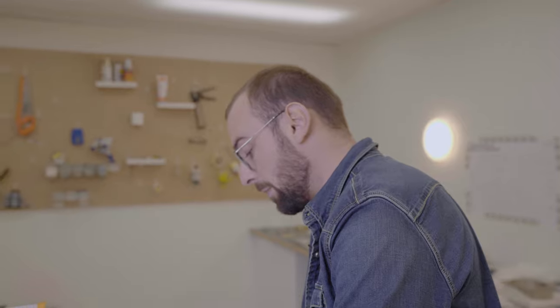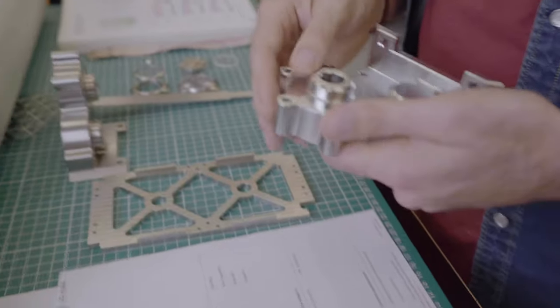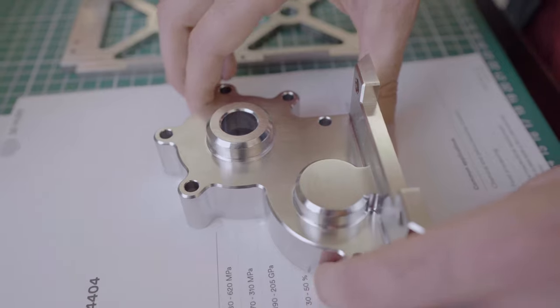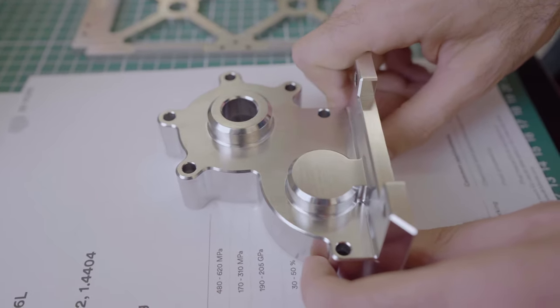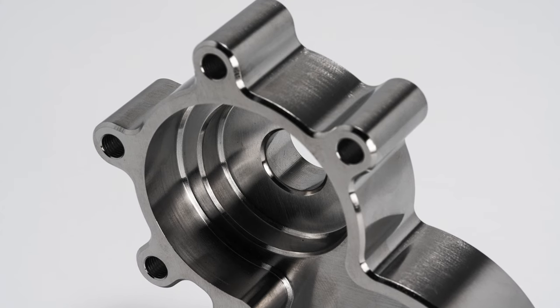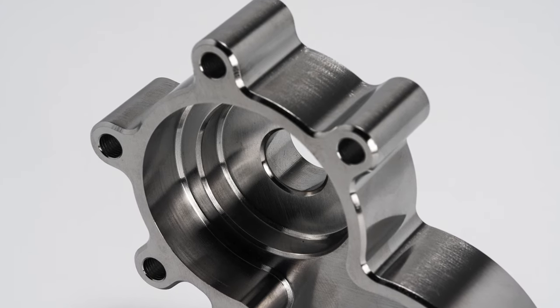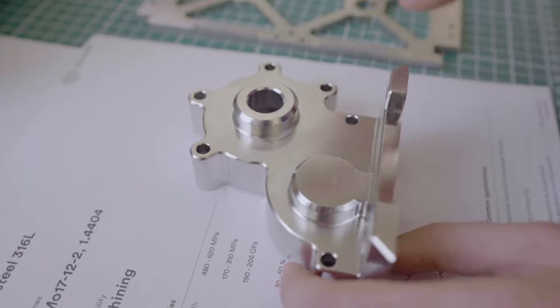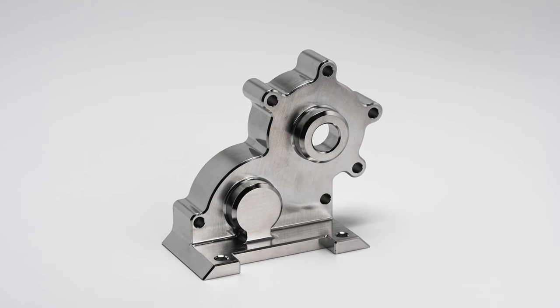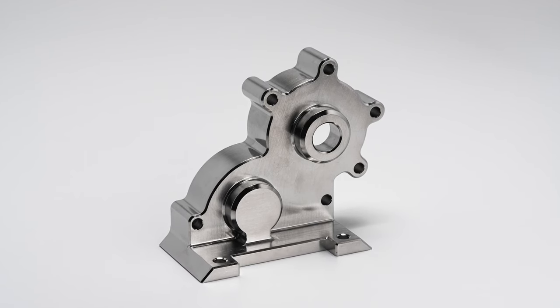Another really common and popular finish done after brushing is electropolishing. Stainless steel is a material that can be electropolished — you put your parts in a very acid bath and while running electricity through the part, you actually smooth out the part at a microscopic level. I should note that electropolishing does not give you mirror-polished parts, but it will smooth out all the surface features at a microscopic level and make them slightly brighter, removing the dullness of the part.